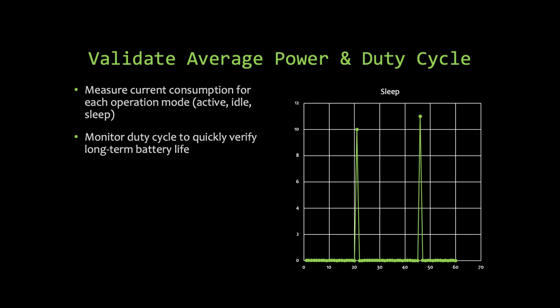I love this slide because it usually frustrates firmware engineers to no end. In the release package for firmware, I have added many different power tests because, as I'm sure anybody who's done low power systems knows, you can make one very small change to firmware and have a very large impact on power budget. And usually it is the changing of how often the thing wakes up.